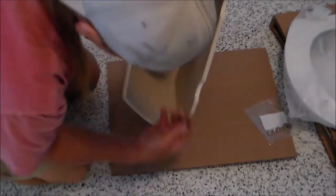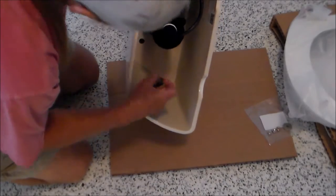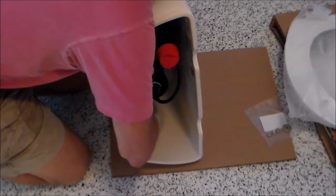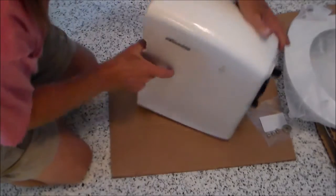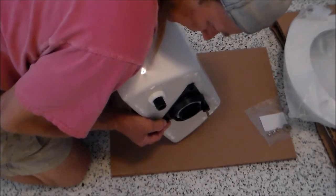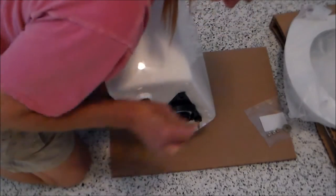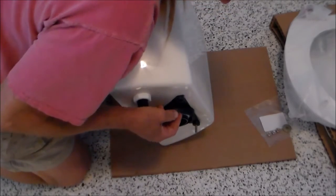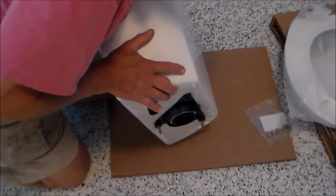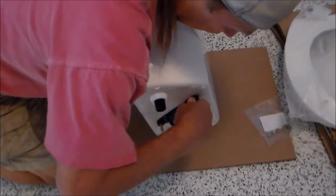Take the water closet and you want to insert these bolts, and they have rubber seals to make sure that there's not going to be a water leak. And you can see here that on the underside there is also a rubber gasket, so these need to be inserted so that we can set it on top of the tank. Some tanks have two screws at this point and some have three. The one I removed had three, the new one I'm inserting also had three.